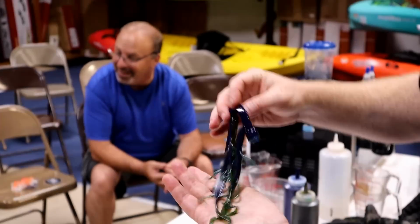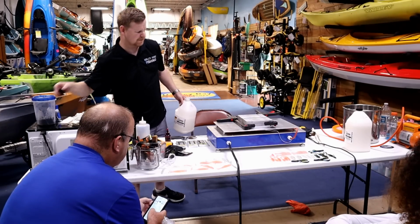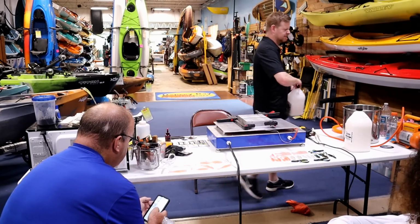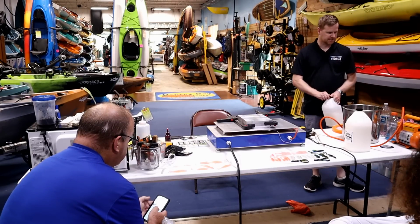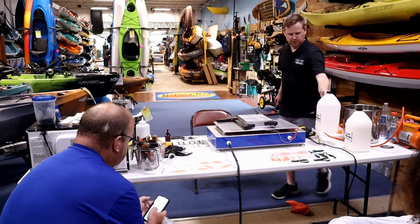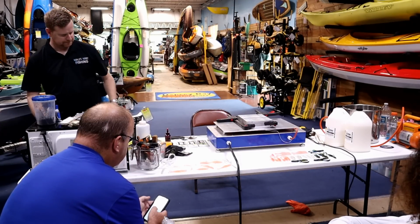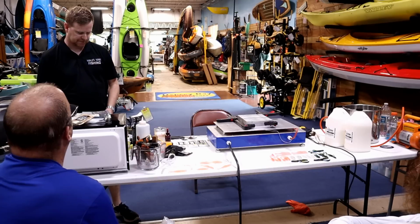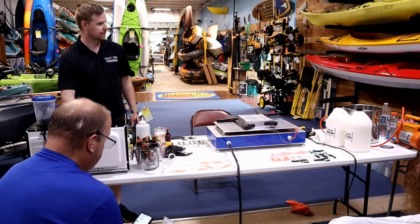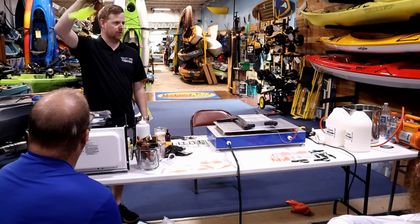I'm just going to take one just to try it. If you don't get it to 350, it'll result in a runny, gooey mess. You've got to get the resin mixed in, or else it's a bad day. Is that the same for remelts too? After they set up, do you have to get it to 350 again? Nope, you just have to get it hot enough to where it's just remelted. Oh, this does not need to be chemically converted again.